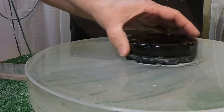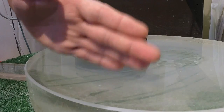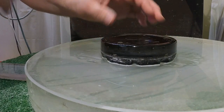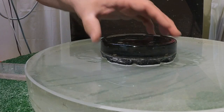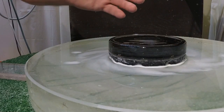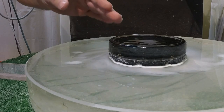In the last session, prior to this one, I had a high area in the center from about the five-inch range on in, and I'll show you the stroke that I used to fix that up. We'll add just a little bit of cerium oxide here. This is a thick version of cerium oxide so that you can see it. Normally in figuring at this stage, I'd be using quite a bit thinner than this.